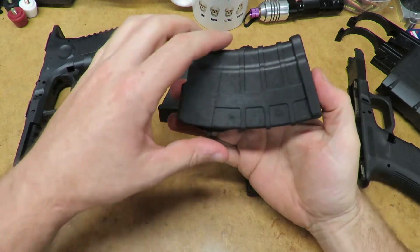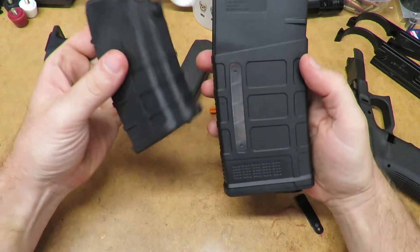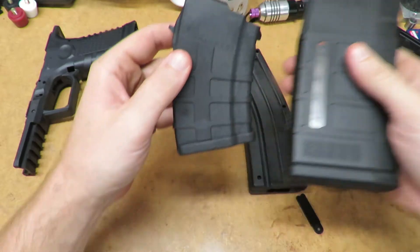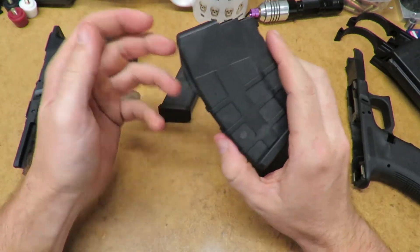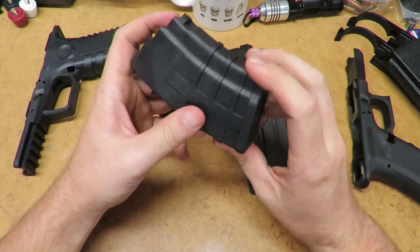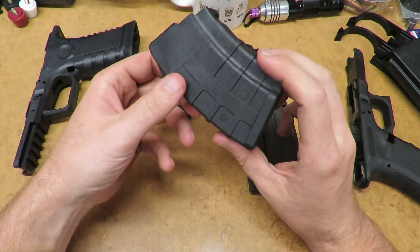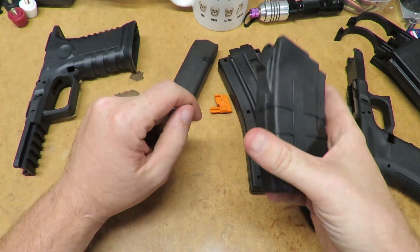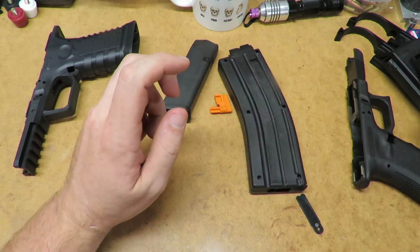The Tapco mag is made about the same way. If you wonder why the Tapco looks different from the Magpul — the texture and surface finish — that's because they run the mold cooler. It doesn't get that molten smoothed-over look, and it saves money on power and preserves the life of the mold. Running them hotter wears them out quicker, because the hotter the metal gets the softer it gets, and most molds are made out of aluminum.